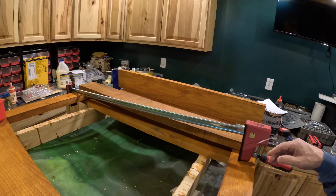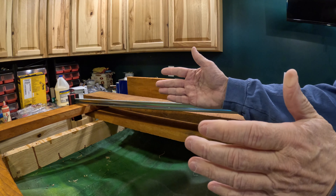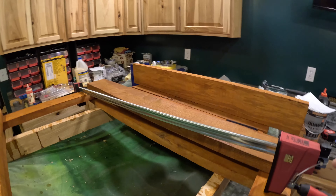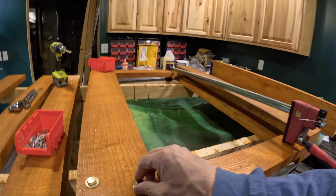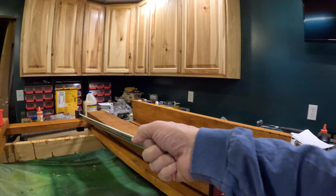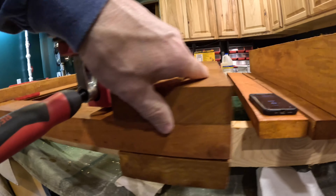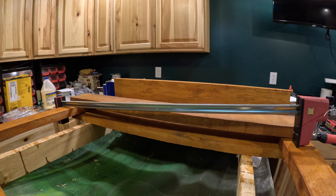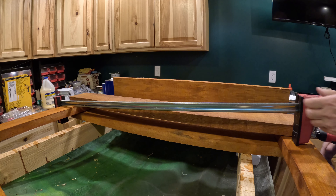What I did here was — the frame was shifted a little bit and the stringers on both sides were wider at one end than the other. So I loosened the bolts up and just by hand pulled it tight — the clamp wasn't quite big enough — and now I'm square down at the bottom on both sides as well. Just a little tip if you're having trouble trying to square it up. I could put it down on the ground as well, but I want to be able to drill up high — it's a little bit easier.